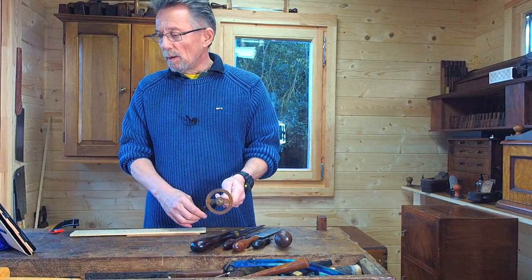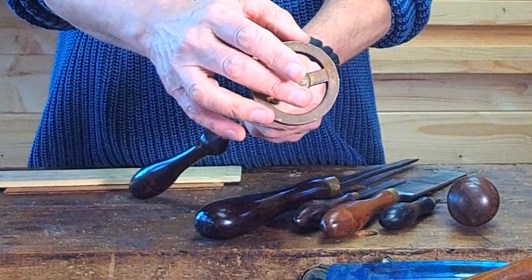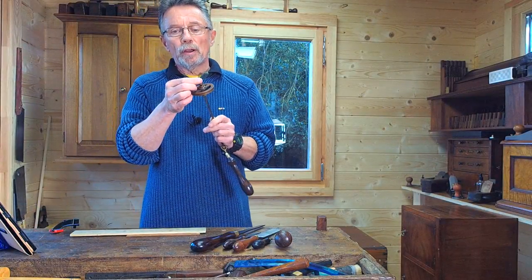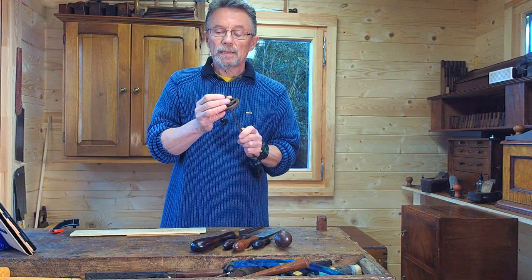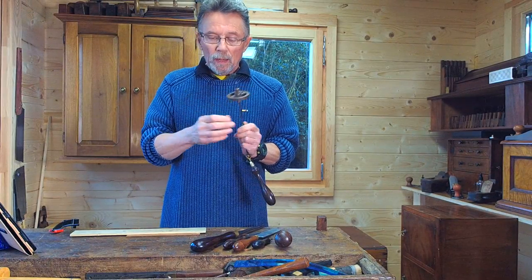These bits are quite easily found for other drills — they're spade bits with 45-degree points. Having watched Chris's video on click spring recently about the Antikythera mechanism, he shows how to actually manufacture these. They're not easy to make — they look it, but they're not. So I took a twist drill, cut it down by snapping it off, then grinding and honing it on diamond plates. It seems to work well, though it's not the sharpest yet.